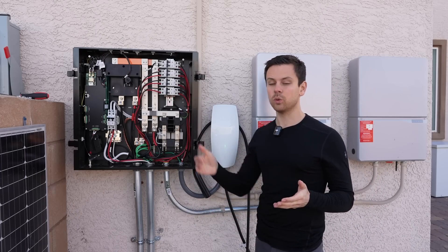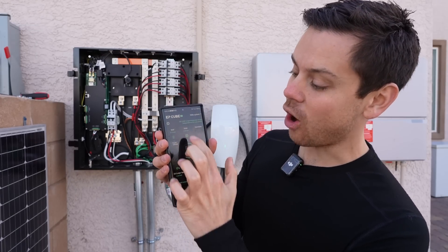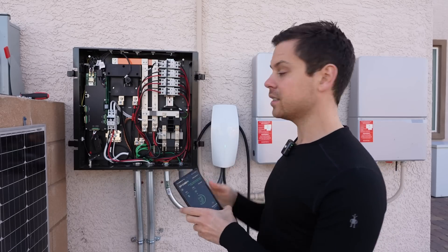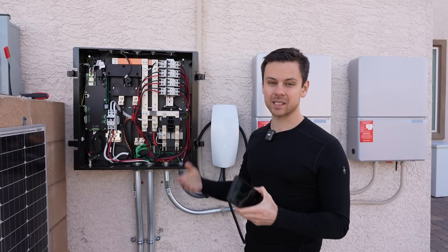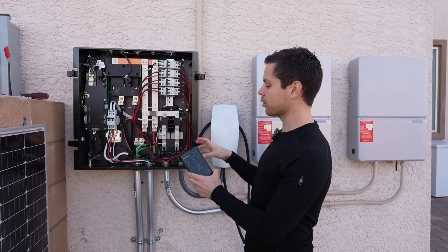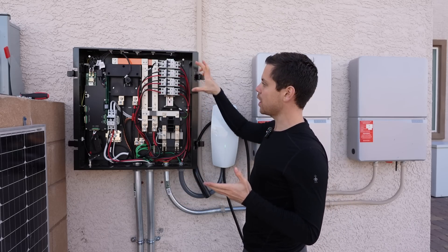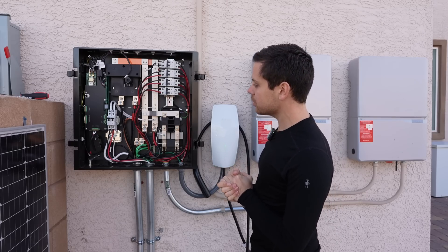Anything over the charge rate that's not being used will go out to the grid. Right now we're charging these batteries with the 18K and also with solar — all systems working together, capturing all the energy I'm creating. If you have a generator, you can connect it to the gateway. There are contactors, voltage sensing leads, and CTs specifically for generator use. It matches the hybrid inverter's output to the generator's waveform so they work together. You can also use it with EV chargers or grid-tie inverters. You can even add loads without monitoring them and add 240-volt loads to the panel.